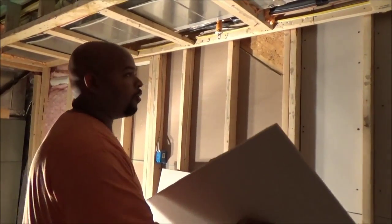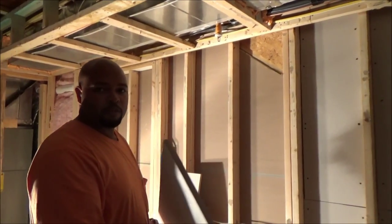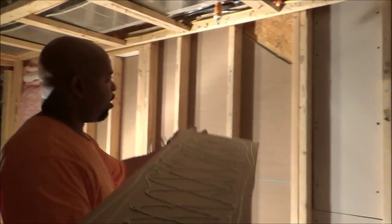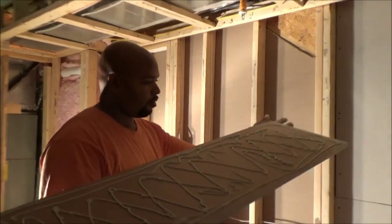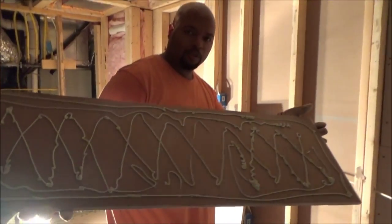In this room, one obstacle is that the rear wall also shares a wall with the staircase. What we're doing to enhance the soundproofing is loading drywall with green glue — we're going to put two layers up against this wall in between the studs. And then we're going to build a double wall with triple layers of drywall and green glue. You just saw me put the green glue on, so I'm getting ready to load it up here.